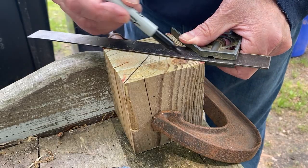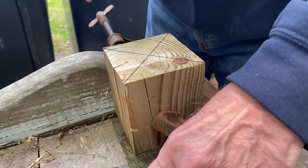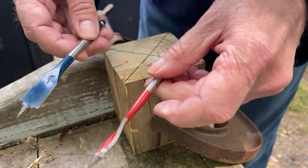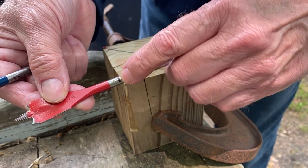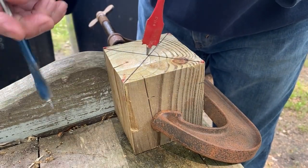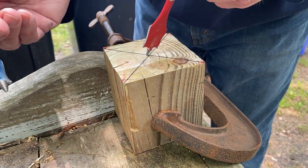Okay, we need to find the center — and that's done. As I said, we need two spade bits. The center hole only goes down two-thirds of the way — that's your first hole with the three-quarters bit. Then all the subsequent holes on the sides, which we want the carpenter bee to enter, will be drilled with the half-inch bit.